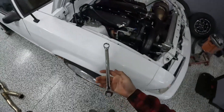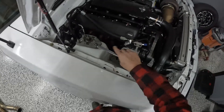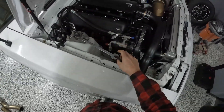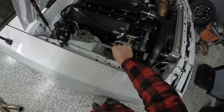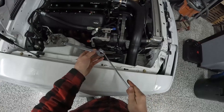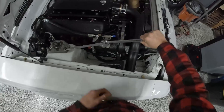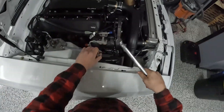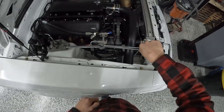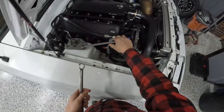We will start out with a very basic wrench trick. Lots of people know this one but if you don't, this is going to be the most used one you'll have. So you've got a really tight bolt — impact guns are all the rage but not everybody has one — so to get more leverage on the bolt you can actually grab another wrench, lock it in like this, and you see how much easier that comes off. A simple act of doubling up the wrench doubles the leverage, so I can take this bolt off with one finger.